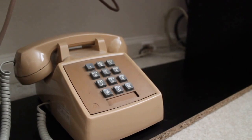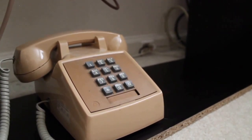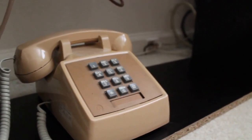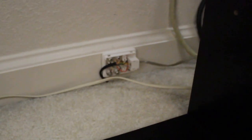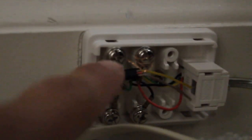Let's start with how do we get phone service to the room. We can see here we have a standard Western Electric 2500 touchtone set. The line is disconnected here for visibility purposes. The phone line would come into this phone jack, and the phone jack would terminate here coming from the telephone, and then we need two wires — tip and ring.